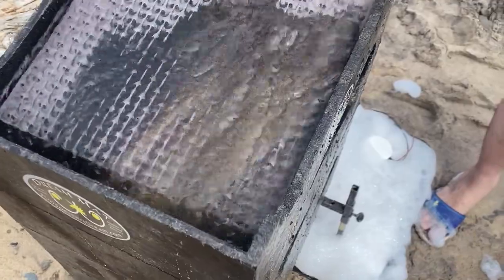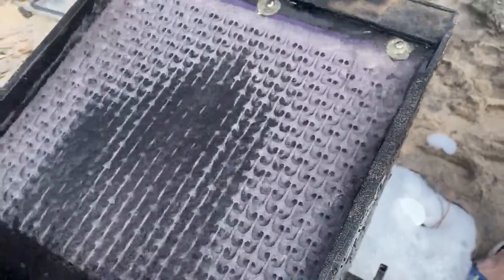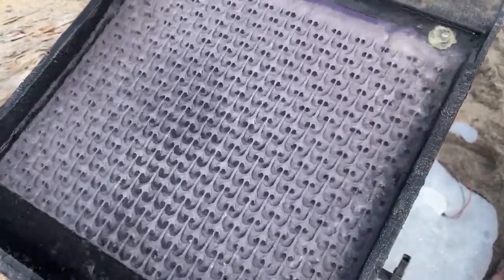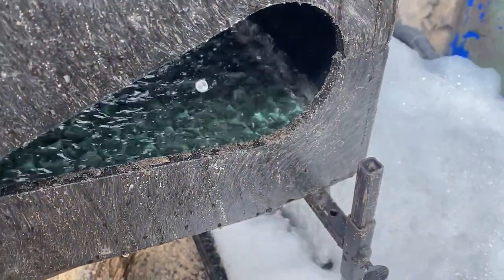So you dump it in a gold cube into a micromat — you can see how it separates and how it's going to settle into the cells. We saw quite a few pieces of gold in the cells, so it looks like it's working pretty good. We've got a micromat on top, micromat in the second layer, micromat in the third layer, and then a KP in the fourth layer.